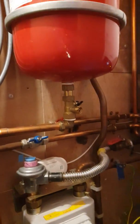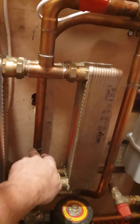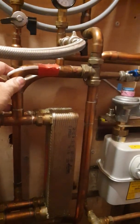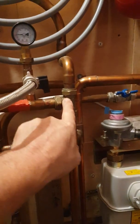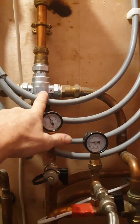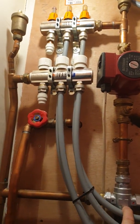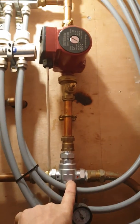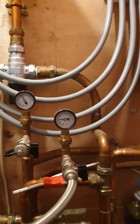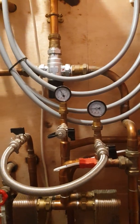So we've got the flow from the boiler on the back side of the plate heat exchanger, and the return from the boiler on the lower side. We have the flow out to our systems — this one's going up into a standard fixed temperature blending valve, and this does the underfloor heating in the bathrooms upstairs. This is fixed at a relatively high temperature and will basically warm those floors up — those floors are toasty.